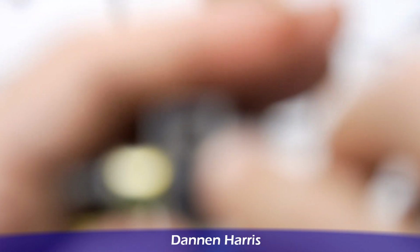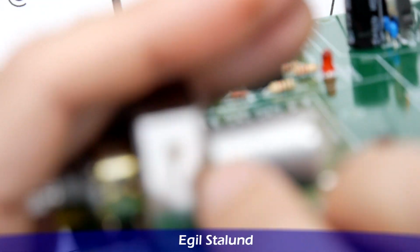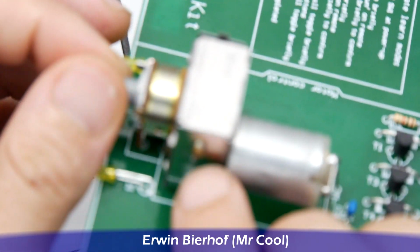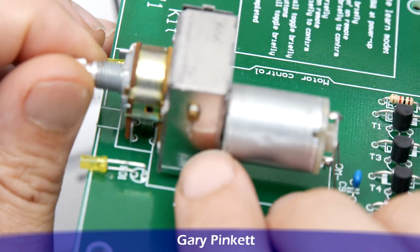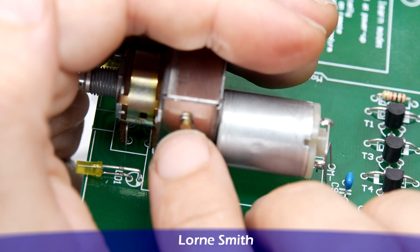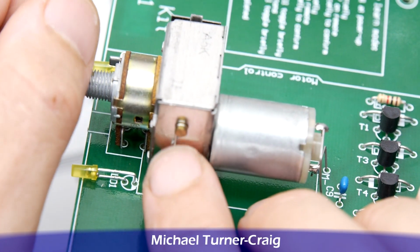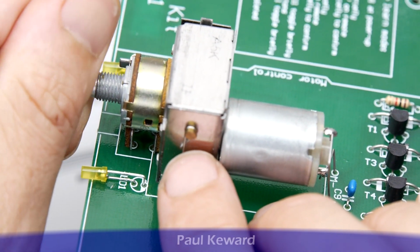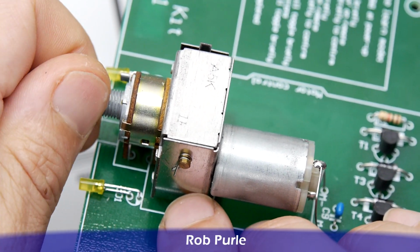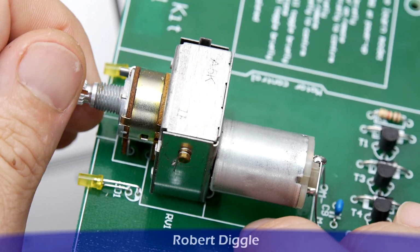Just to show you what that was, there was actually, strangely enough, and I'll check in the box, it might turn up, a missing circlip. So if this camera would focus, please just focus. Okay, you can see it there. I've actually just put a twist of wire that's stopping that getting pulled in. So there should be a circlip on there. If yours doesn't have the circlip, you see that thrust pulling it in? It won't work. It needs to be outside the unit.